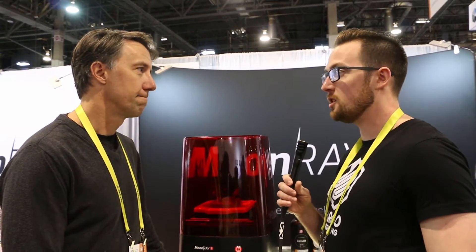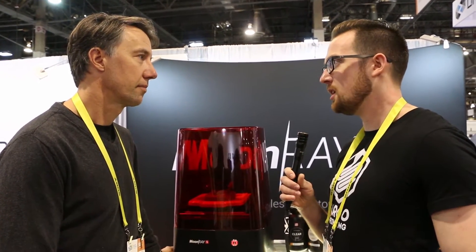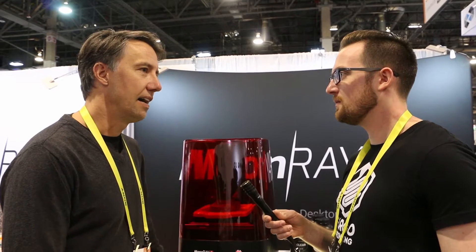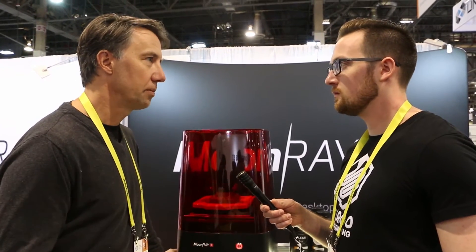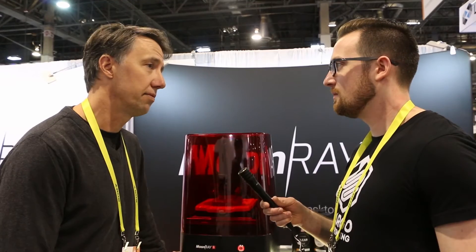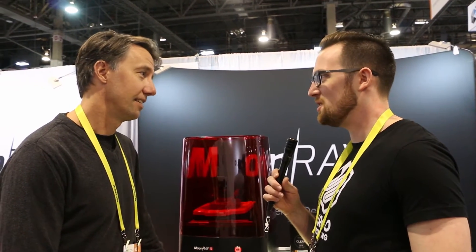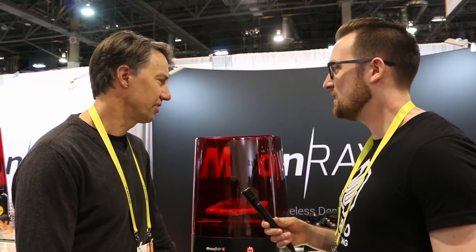Are there any other advantages of using a DLP projector over a UV laser? I really think it's about dependability, and it really comes down to the fact that our resin tray — you don't have to replace it. Some of our competitors, you do have to replace that quite a bit. The maintenance on this is very low. As soon as you're done with that print, you just pour the resin back into the bottle, wash it off, wipe it off — very low maintenance. And built into the resin tray, I see there's a little spout to make it even easier to pour that resin out so you don't make as big of a mess. Absolutely.